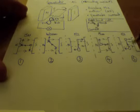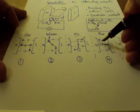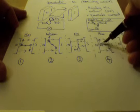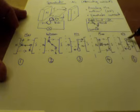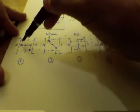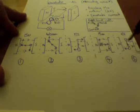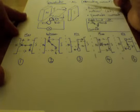So, let's look at the other side. It started to come out of the page, the dot. It continues to come out of the page. Nothing happens. As it cuts back through the field lines, the opposite effect happens. And then as it gets to the top, nothing happens. Now that might look a bit confusing, but that makes sense. We go from maximum to nothing to minimum to nothing, alternating current.